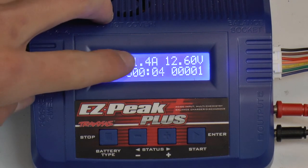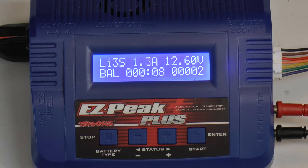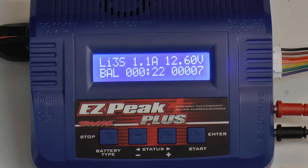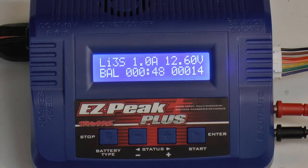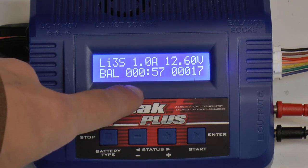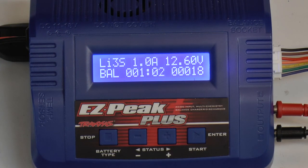You will be greeted with this screen. Here is going to be the charge rate the charger is charging at. This battery I'm charging is almost completely full, but if you ran it in your car for a couple of minutes you'd be up at the full capacity you're charging at. Over here it tells you the status of your LiPo. Normal LiPos hold 4.2 volts per cell, or 12.6 volts for a 3-cell LiPo — some people think it's only 11.1 volts, but that's actually 12.6 volts for a 3S. Here is your time counting up and here is the number of milliamp hours the charger has put into the LiPo.